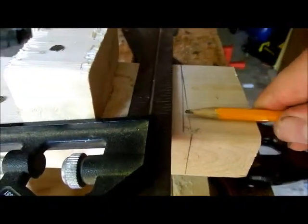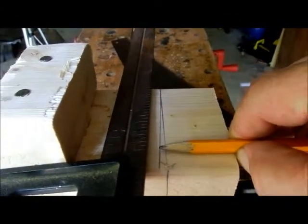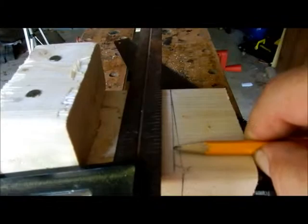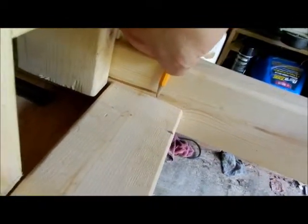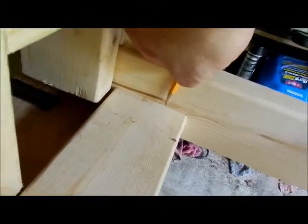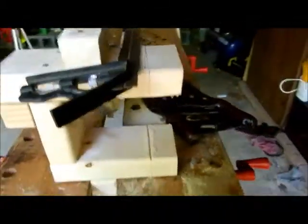Now this is always a nice little tool to make a straight line. What you could do is take your finger, put your nail right where the edge is, and your point right there, and you can come over and come down right here and make sure you're clearing all the way across. It looks like we have a quarter of an inch above, so that's really good. You want to do it to both sides, but I know both my sides are about the same — so that means it's going to be a good cut.